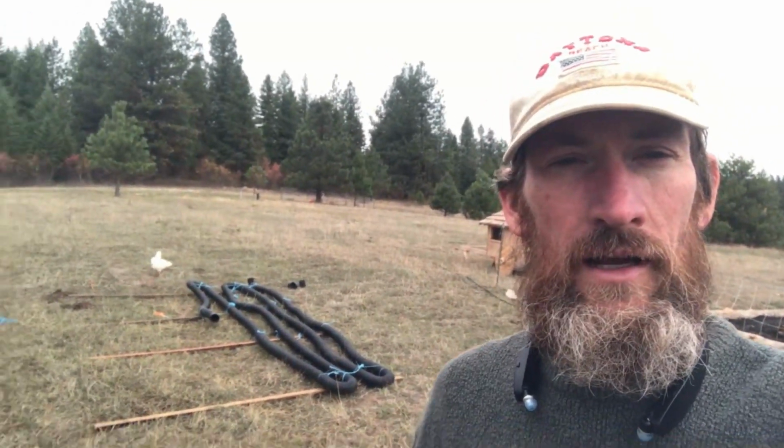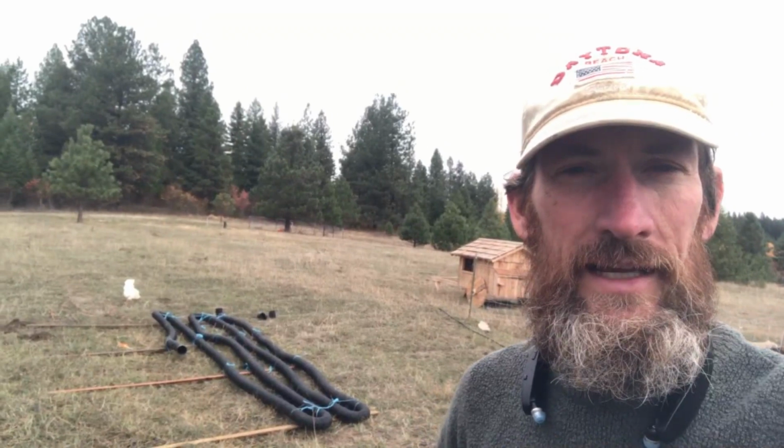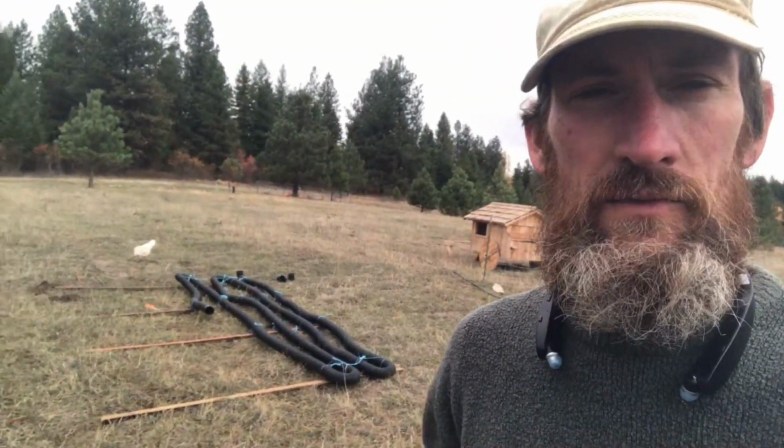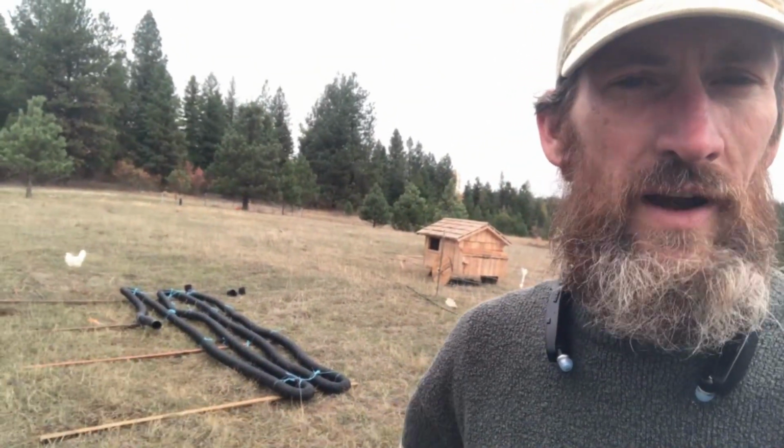The air pipes that we're putting underneath the geothermal greenhouse are going to just be zigzagged back and forth like this. We have the option of building them in the ground once we've dug, but tomorrow we only have 8 hours on the rental for the digging machine, and I don't want to spend any of that time building this. So the idea is we're going to build it out here on this wooden frame, and then hopefully we'll be able to easily drop that into the hole that we dig tomorrow in no time, without taking any of the expensive rental equipment time.